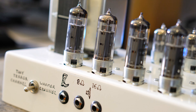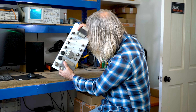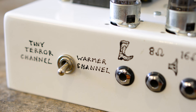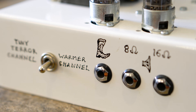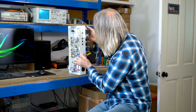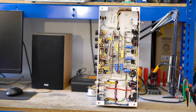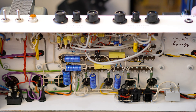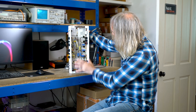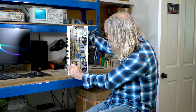I built this prototype — it's kind of like an exotic British thing because those were the parts I had lying around. On the back, we've got a boot for the foot switch and a channel switch if you want to do it manually, and a 16 ohm output. Inside, it's completely point to point. I dead-bugged the relays for the switching. It was designed on this chassis — a custom shop chassis.